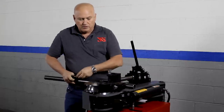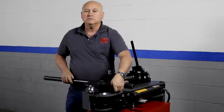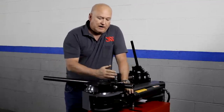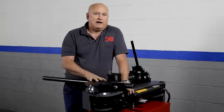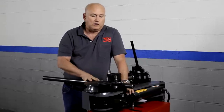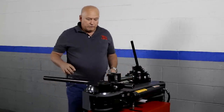Now we put our U-strap in the bender. On the die there's a lockdown bolt — you can lock it down to help prevent tubing from slipping through the bender. On Model 50 series benders like the 52, 53, and 54, you don't really need it, but it's there anyway.